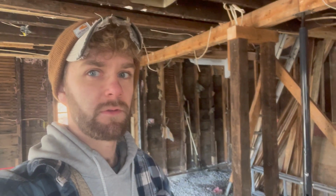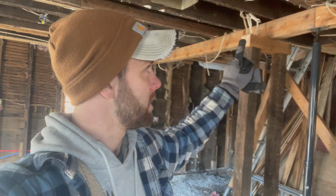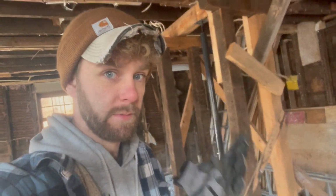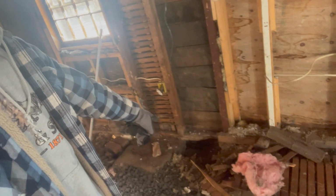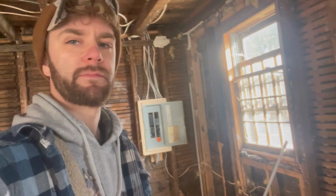So I don't really know where I left you guys off in my thinking process. I've been standing here for a little while. Step one, I'm gonna get a bigger plate. So I'm gonna leave the cradling for now so that I can lower it back down, put a new plate on, maybe. I wanna figure out a better situation for this, even in the temporary, which means I'm likely going to get a couple bags of concrete, refill in down there, and put in a new sill plate. At least that spans 8 feet or so.